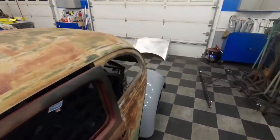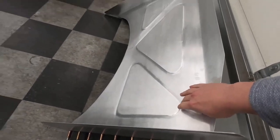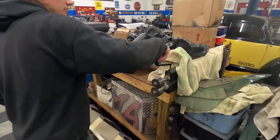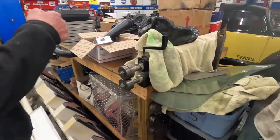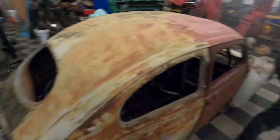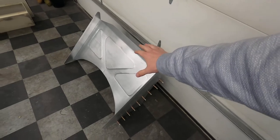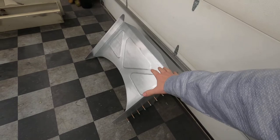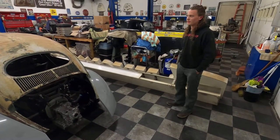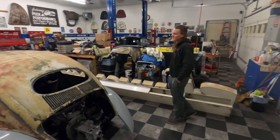I wanted to show you this before we wrap up — the aluminum bodywork has these triangle impressions rolled into it. It's done with a big electric roller machine: you clamp the material in, select the die for your design, crank it down, and just walk it through. It's a cool detail that adds depth to the build. He's going to anodize all the aluminum black, and the car color is going to be a charcoal metallic gray — though there are apparently about 70,000 shades of gray to choose from.